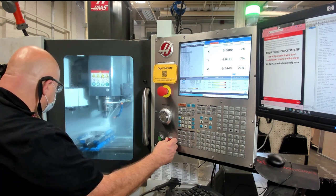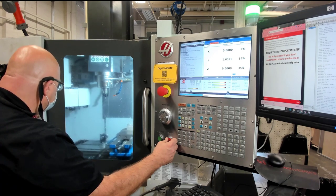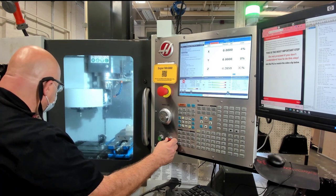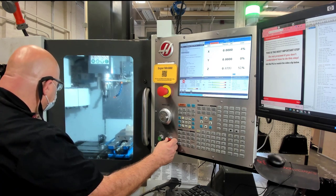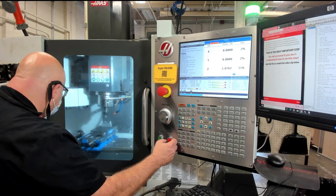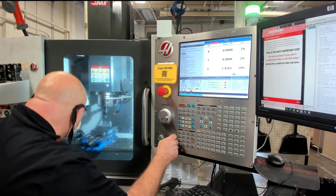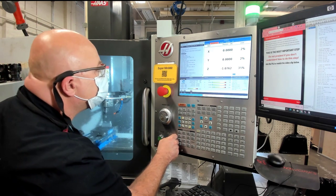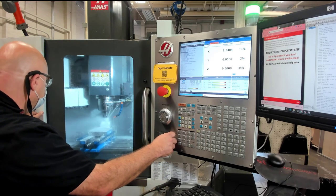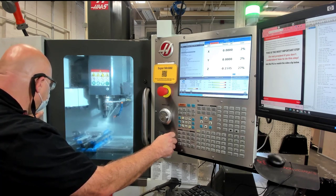Now if you think the machine is crashing, or if you think something's wrong, be sure to press the emergency stop instead of the feed hold button. If you press it and you didn't need to, you can always come back to it. This is the chamfer end mill coming out. As it comes down, we're going to press feed hold, look at the line of code, look at the distance that it says it's going to go, and look inside to make sure that makes sense. It does, so we let it go. It puts a chamfer on the part, and then it spot drills for the two drilled and tapped holes.